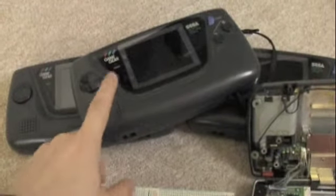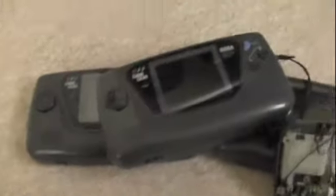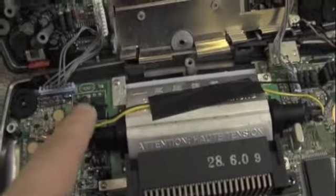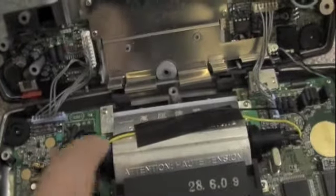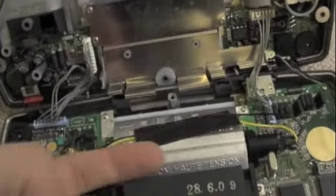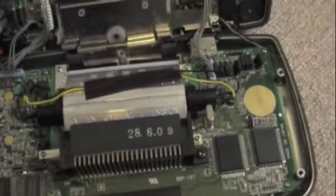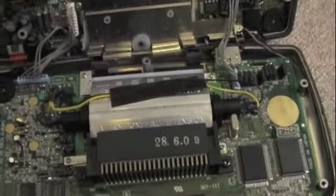What I was going to do while I was refurbishing them was put in the LED mod so that your six batteries last a bit longer than two hours or an hour and a half. I've already done one here with an LED mod — you can see where you take out the transformers that put up the voltage for the CCFL tube at the back and replace them with two 5mm LEDs pointing inwards. I put the tube back in again to diffuse the light a little bit more, but I wasn't convinced with the brightness of it using spare white LEDs from an old project, certainly compared to the original tube.